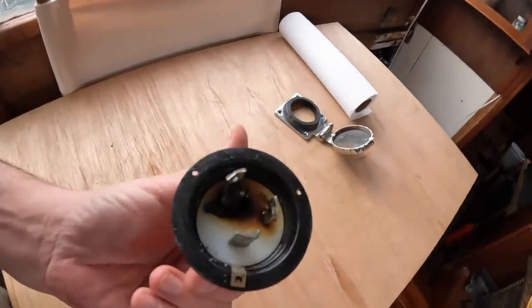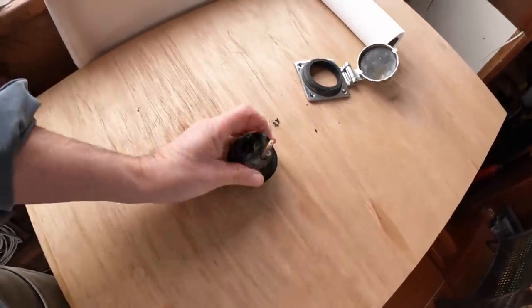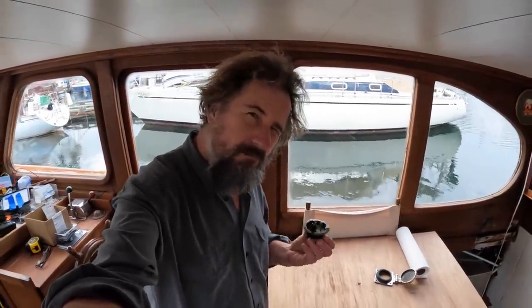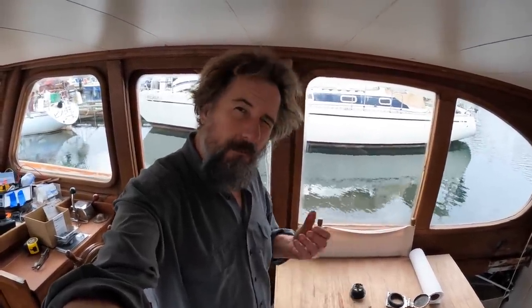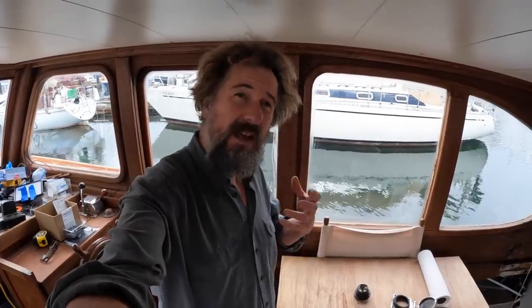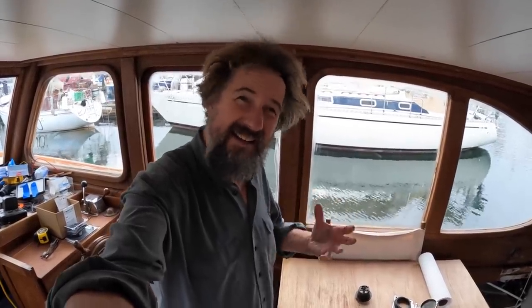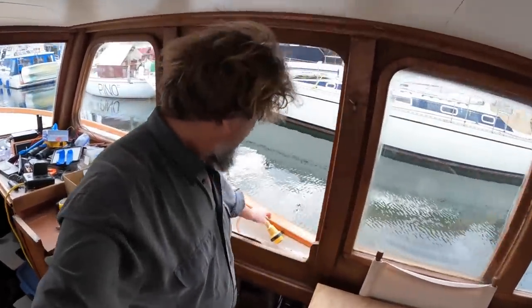this happened. Well, any of you who are familiar with boating, and certainly liveaboard boating, and using lots of power, every once in a while, if you're irresponsible, read me, you don't keep the terminals clean and you consistently draw 28-ish amps and eventually one of the conductors just lets go by having just the slightest bit of resistance. In other words, a bad connection. As soon as that bad connection starts, it starts to draw a lot of current through there and voltage. And when the voltage is dropped across the bad connection, heat starts, it just gets worse and worse. And well, you can imagine what the plug looks like.